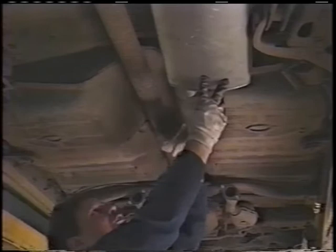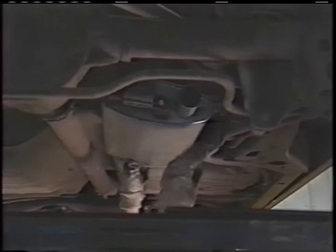If you've made this mark, you'll know where your cutoff is. It'll save you steps to and from the bender. We already know where the muffler's going to be positioned for the tailpipe. We know that it comes up over and out. Since we know that, we can go ahead and free bend the tailpipe and bring it over and install it.